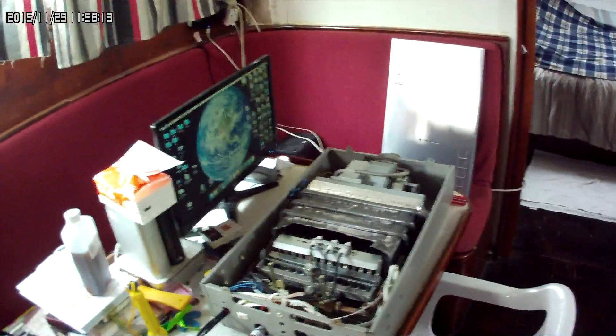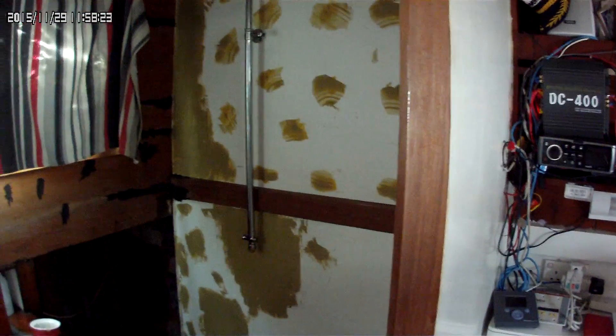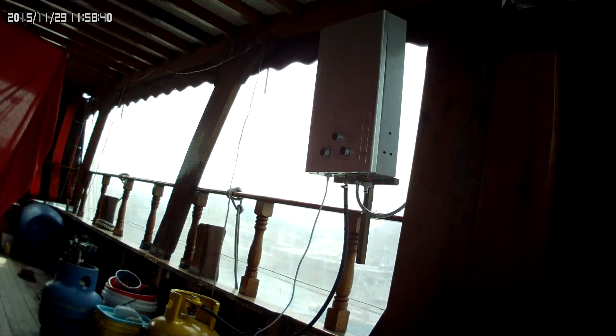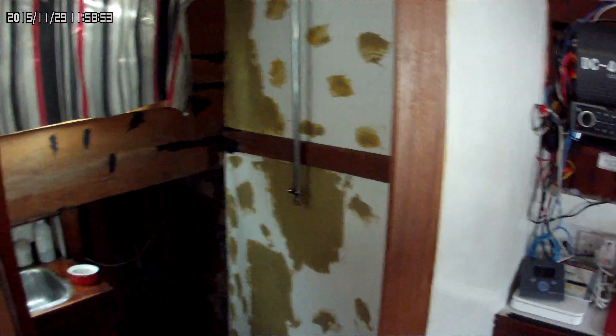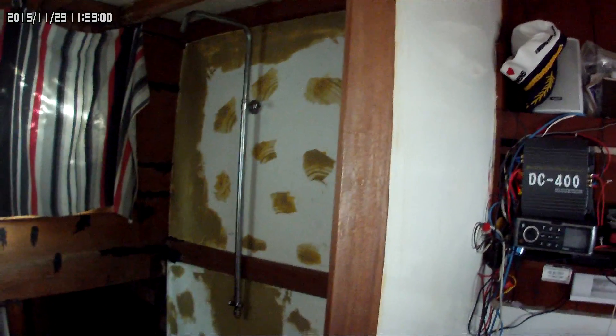At 80,000 BTUs it's endless hot water — well, as long as you have water and LPG. So that's what's happening here. I've got to get this in — I'm going to start drilling the holes to get the pipes in, get the LPG run, then start putting in the wood and finish some demo work in here. The LPG tanks are going to be way over in the back corner, so that's another cabinet I have to build. But you know, it's step by step, and when you start one thing you open up another can of worms.